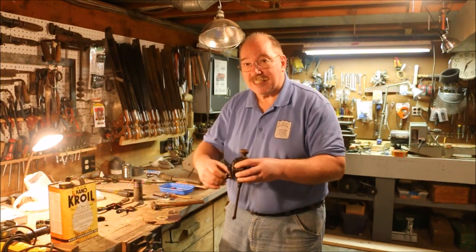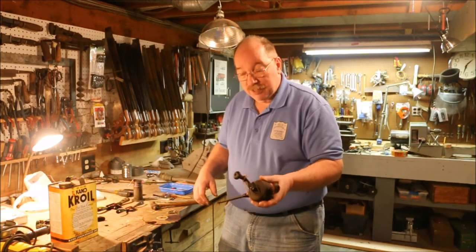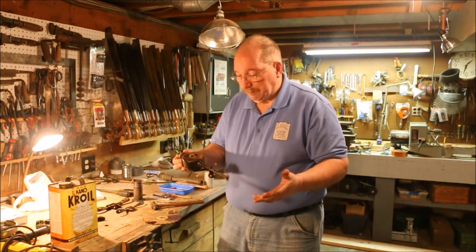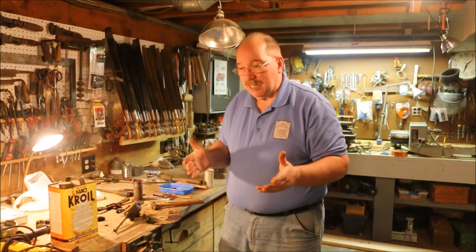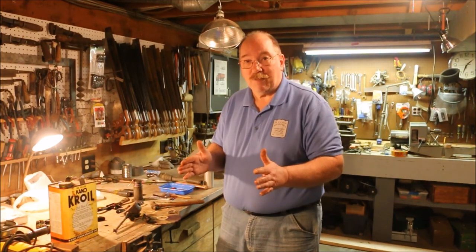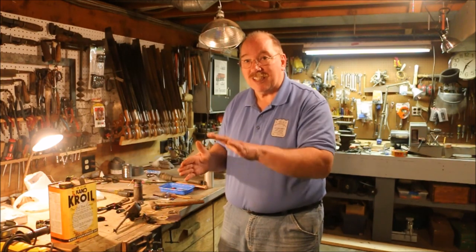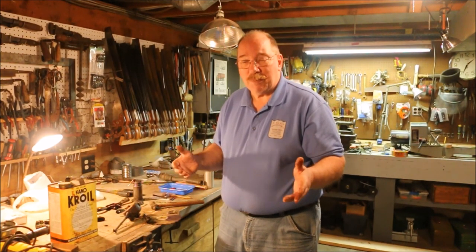The valve is a little harder than the cast iron seat, so the valve shouldn't wear away a whole lot and the valve seat should wear away a little bit. There are actually reamers and all kinds of things that do that, but I was a kid — I was 13, and I didn't have a machine like that. I had a little suction cup on a wooden dowel and I was supposed to just roll it back and forth in my hands. I had more patience than I had anything else, and I obviously didn't have any experience doing valve grinding, but I certainly had the patience to continue grinding on that valve. When my neighbor came over to find out how far along I was, he realized I had ground it way too far. We ended up cutting almost a 32nd of an inch off the end of that valve just to get it to go down into the seat. But it worked, and I had fun riding on the go-kart or mini bike or whatever we put that thing on — it's been so long ago I've forgotten.